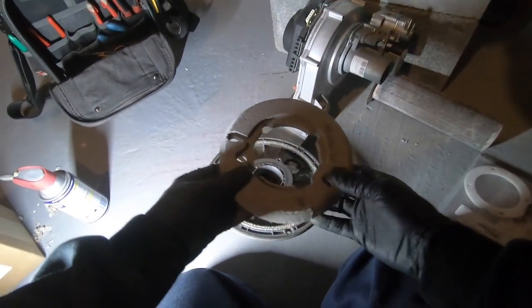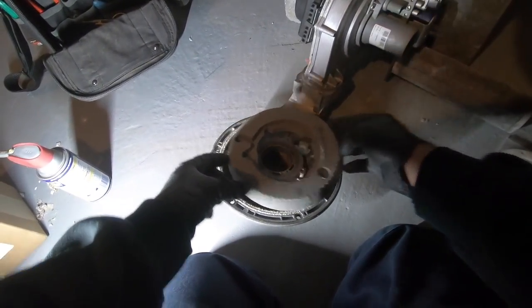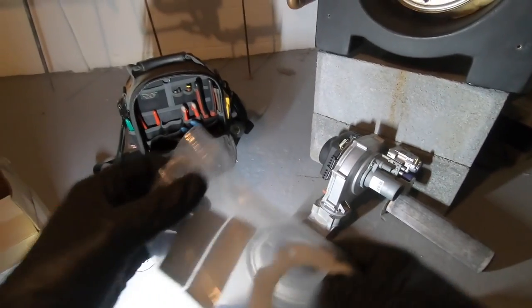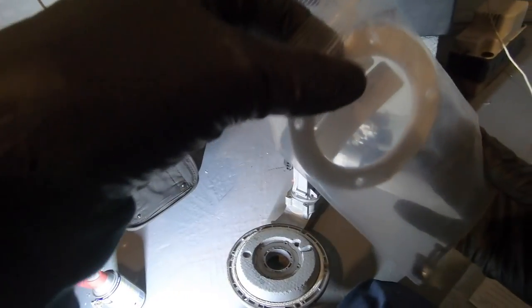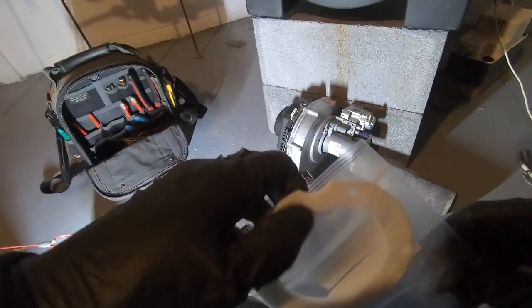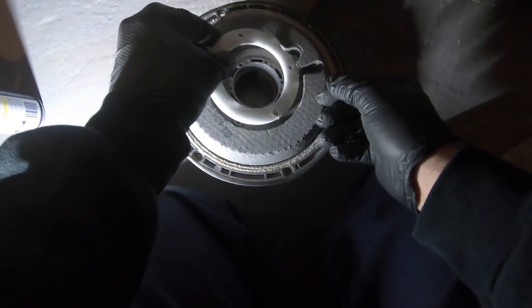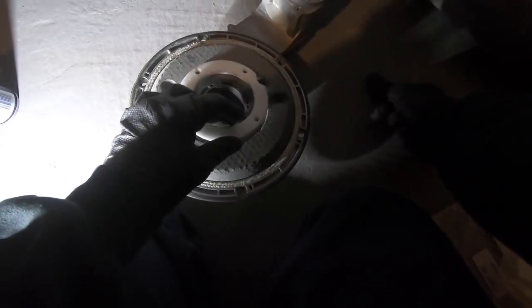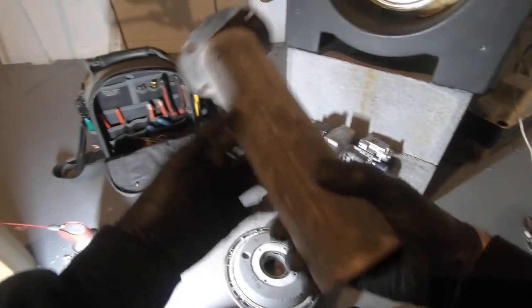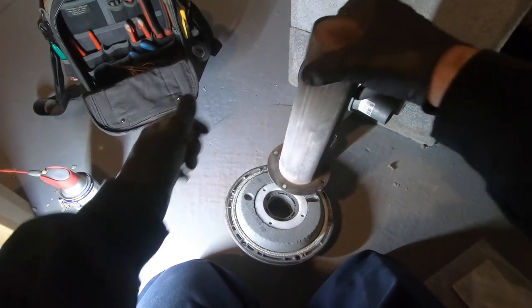So you have that there, you have your sight glass here, right here, and everything is lined up on that. We're going to use our gasket and line all those holes up for your burner gasket. It's already clean; last week I blew it all out and everything.